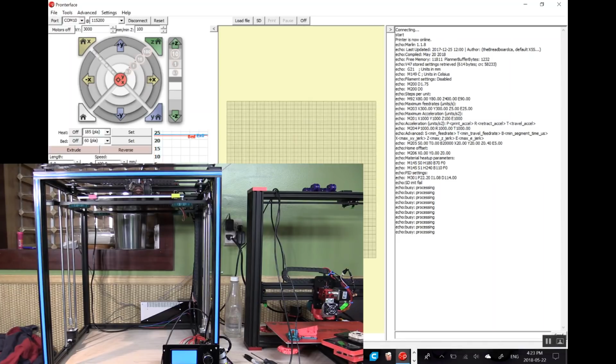So that's homing. What else are we going to try here? Well, you're seeing the mesh bed leveling and things like that. So it looks like this basic controller is working. I'm not going to waste too much time on it without the LCD working, because I really want to be able to run these independently as well. So I know I can drive these. Let's just do Z plus on its own. So that's all working fine. PID tuning, I just got to look up the G-code for what the PID tuning parameter is. I think it's an M something.